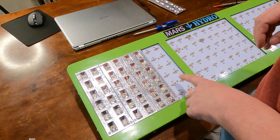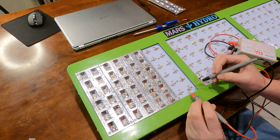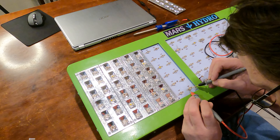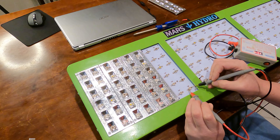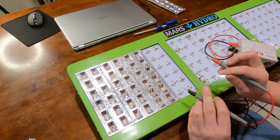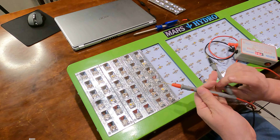Now that we've got our first section exposed, I'm ready to use the tester and test through the series to see if any of these are bad. Because I'm lazy, I want to find what's wrong before I have to take them all off. With the tester I just have to find the polarity on the board - I can see the positive on one side, negative on the other. I may have already found my dud. That's the way they're supposed to light up - that's a good LED. But this LED is not lighting up, so that would be a bad one.